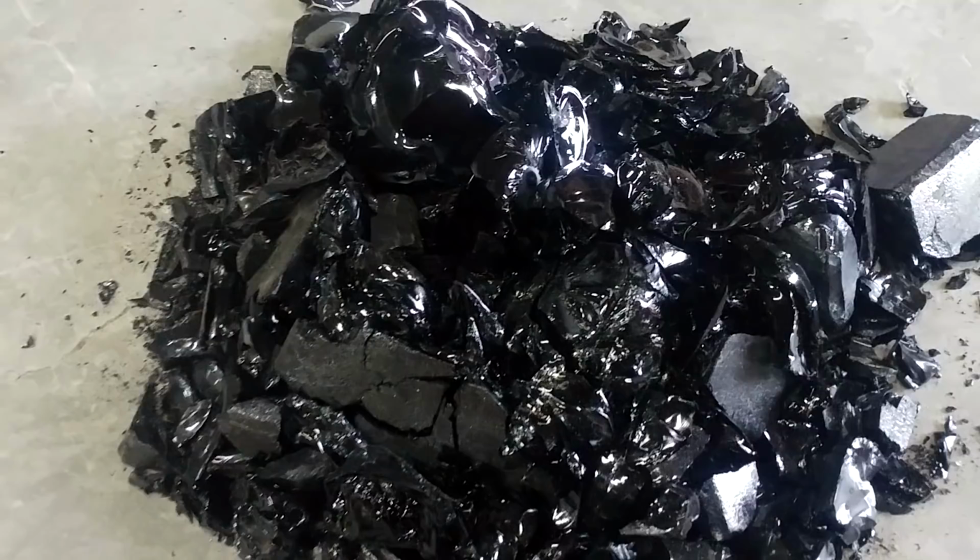So that's the results of our reprocessing old gold slag, both through the turnkey system and also through smelting. My recommendation for this guy is to process through the turnkey system, get a high grade concentrate, and then smelt it down, because as we saw, smelting of the raw slag and mat doesn't produce a whole lot of metallic fraction or gold.